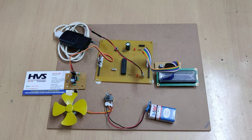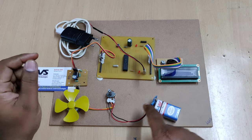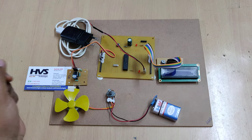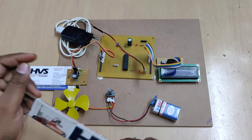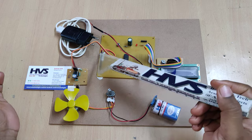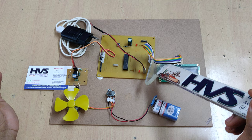We are going to change the speed of this motor using this potentiometer. Through the potentiometer, a 9-volt battery is connected as a power supply source to this DC motor — so here we are using a 9-volt DC motor. We have interfaced this IR sensor at pin A4 of our microcontroller, and the LCD interface uses pins B2 through B7.